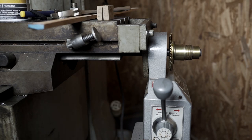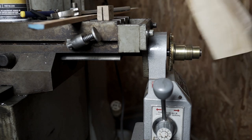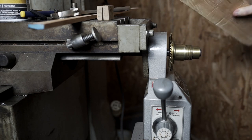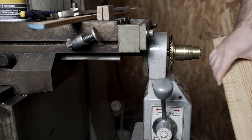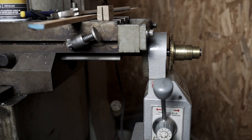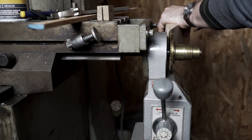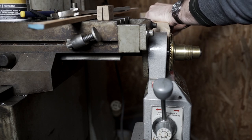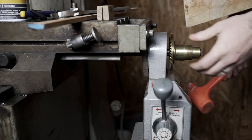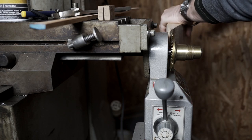I've got these rigger blocks that I used to move this mill. It's probably southern yellow pine — not as soft as a nice white wood, but it should be softer than the gear. So I'm going to gently tap it in and wedge it, then rotate so that we don't wedge it too far out of line.